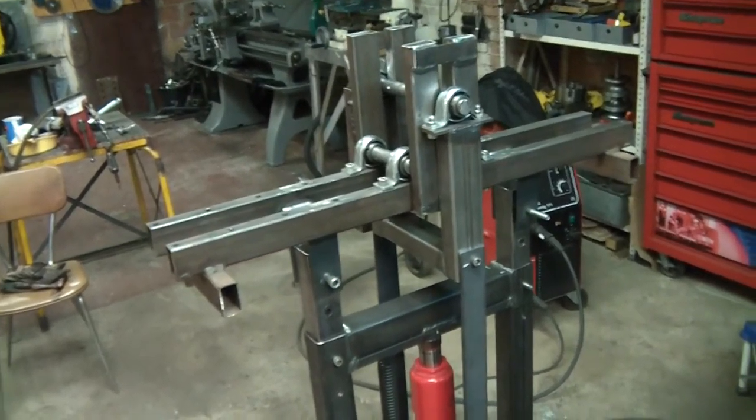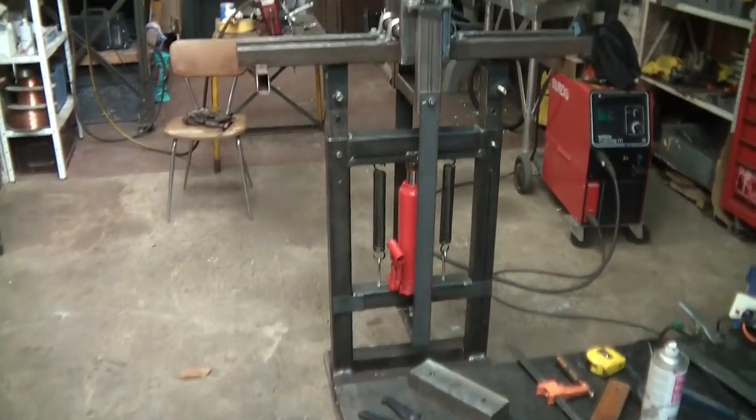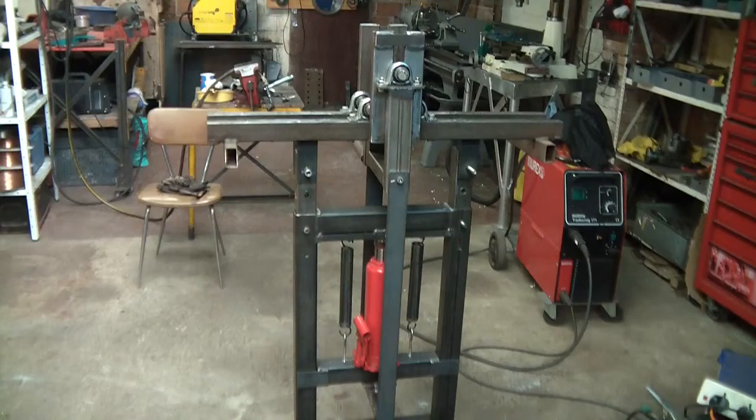Today I'm going to be making one of those to do some scroll work - you can see there. I got the idea off YouTube. What I'll do is make a few of those: weld a bar on the end, stick it in a hub so I can turn it around rather than bending it by hand. I'll put a handle on the back and have a bar with a bearing sticking up so I can just swirl it around.